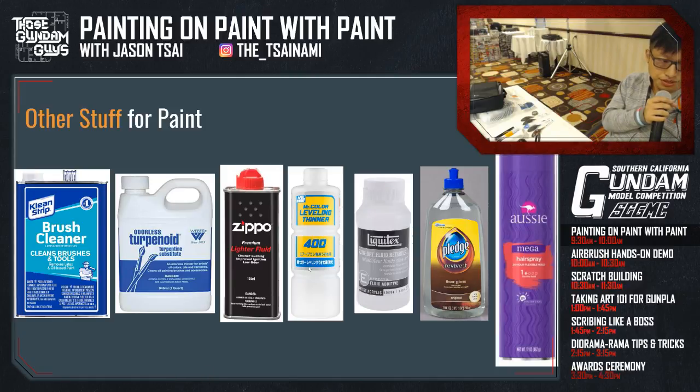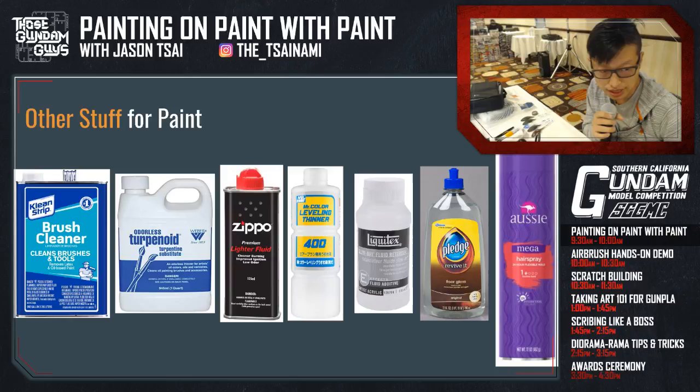It's good for almost all sorts of paint types. It also has a little bit of a retarder in there, so that when you use it, it automatically levels out a lot better. And then you don't have to add a separate retarder for it. And that way you will hide brush strokes if you use it for hand brushing.